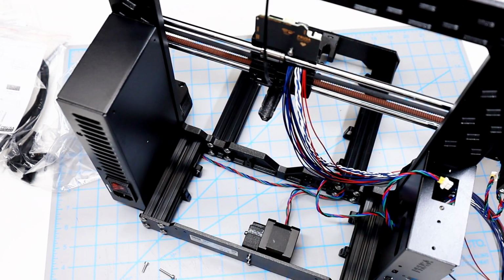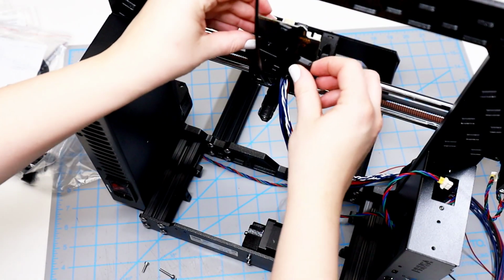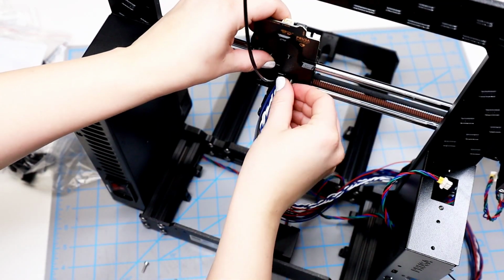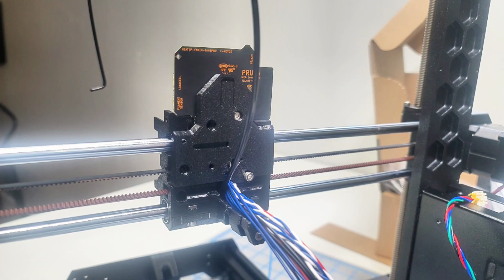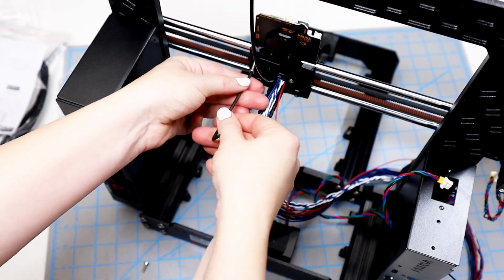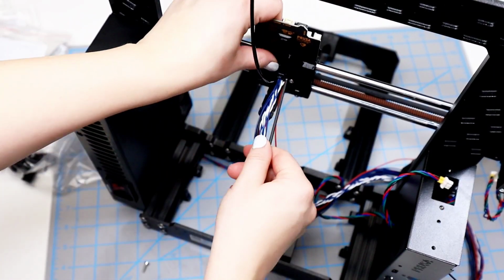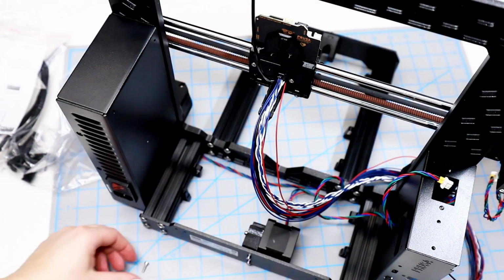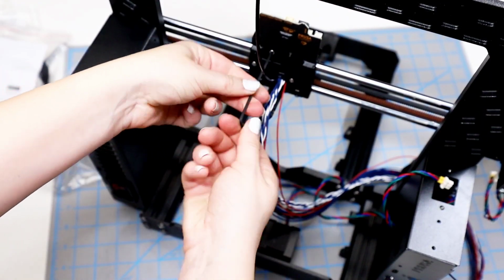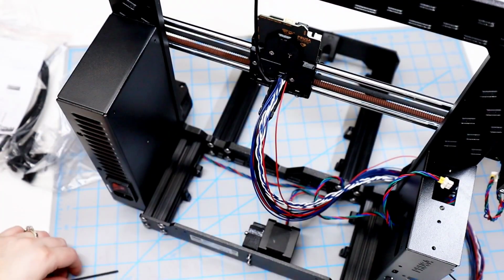Okay, and make sure that the bearing is where it needs to be. Then I set the back plate in place, and I do push down the cables a little bit, and then I secure it with a screw. This is what it looks like from another angle. And I finished tightening that screw and then the other one as well. These are both of the longer M3x18 screws that are on the bottom or the lower side of the back plate. And then I fasten the smaller M3x10 screw in the middle. And then I just go back and make sure that everything is tightened completely.